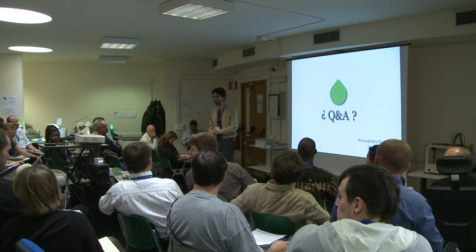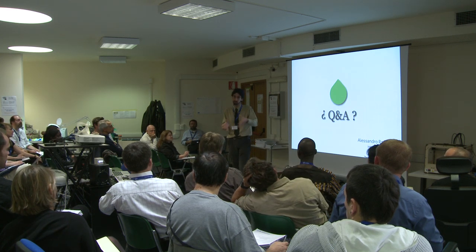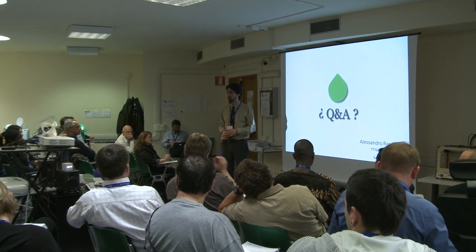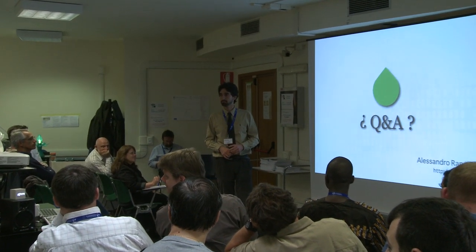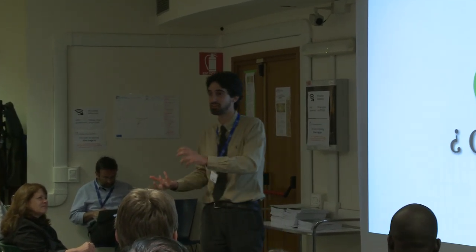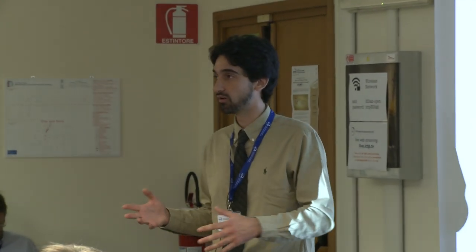And it works with which plastic? All these printers work with almost any plastics, speaking of the basic plastics. PLA, ABS, and PVA are the most common. These are open machines, so you can put any kind of extruder on any kind of machine. The diameter is usually 3 millimeters. There are also printers using 1.75 millimeters filament, but they usually use the 3 millimeters one, and then you can exchange the nozzle orifice for the printing quality.